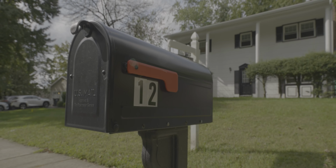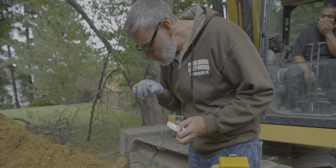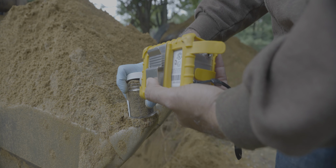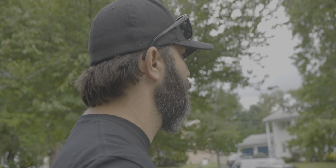So you need a total of 5 samples since this is a 550-gallon tank. He's going to take his post-excavation samples. They all look clean. Hopefully they field screen clean, and then we can start backfilling the excavation.